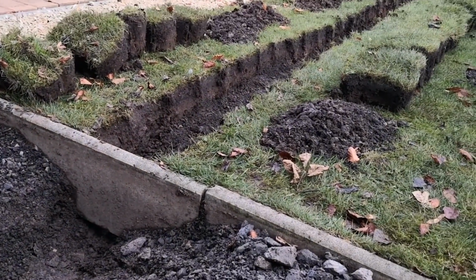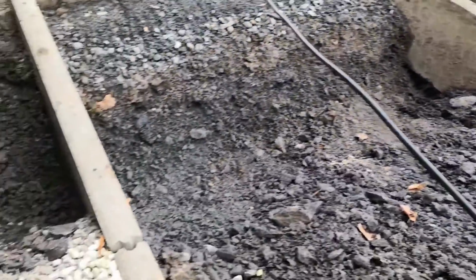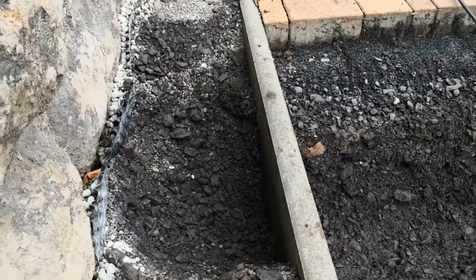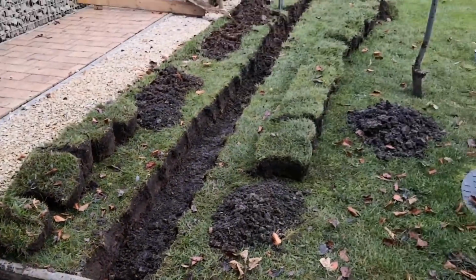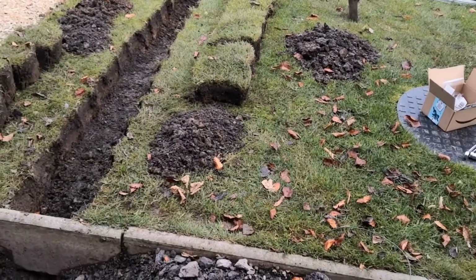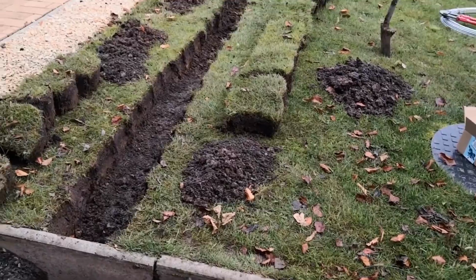In addition, I will lay a second conduit for the electrical system in the trench. This also ends right at the corner of the house. I have no idea when I will need another power supply, a control cable, or network cables, or whatever I need here. And once I have the trench open, I will lay the conduit at the same time. It's simply included and can be very easily connected later.